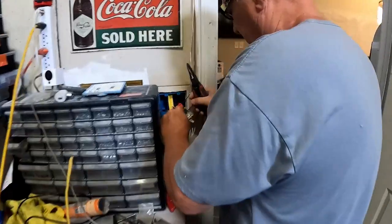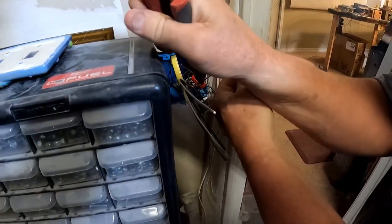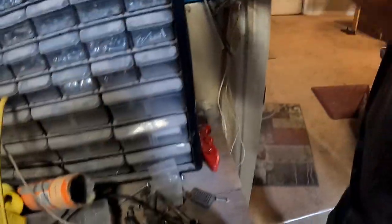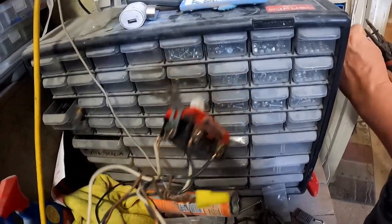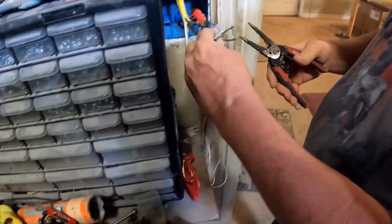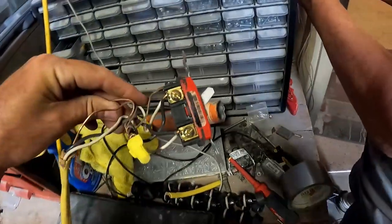All right, we're securing the wires. You're not doing anything into the other switch at all, are you? No - just putting the two different grounds together, and then we're going to wire that switch up. In this switch contraption the grounds get all wired together, then they go over to the ground screw, and then the switch breaks both legs.